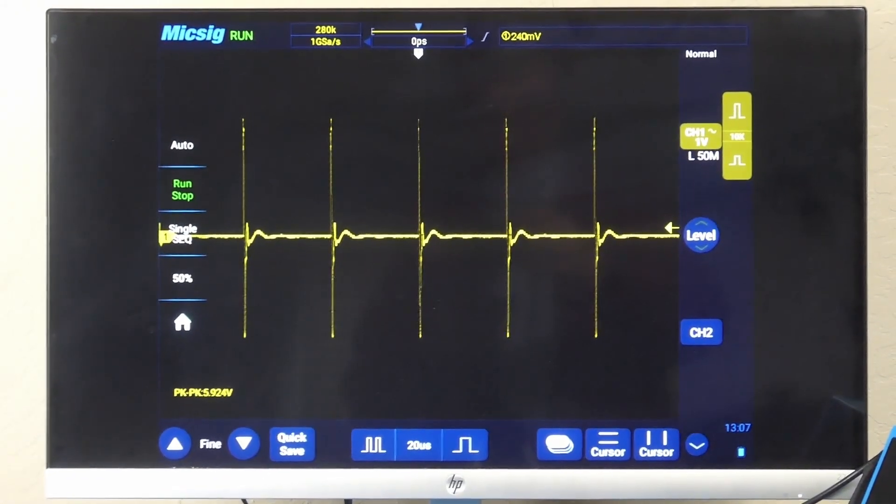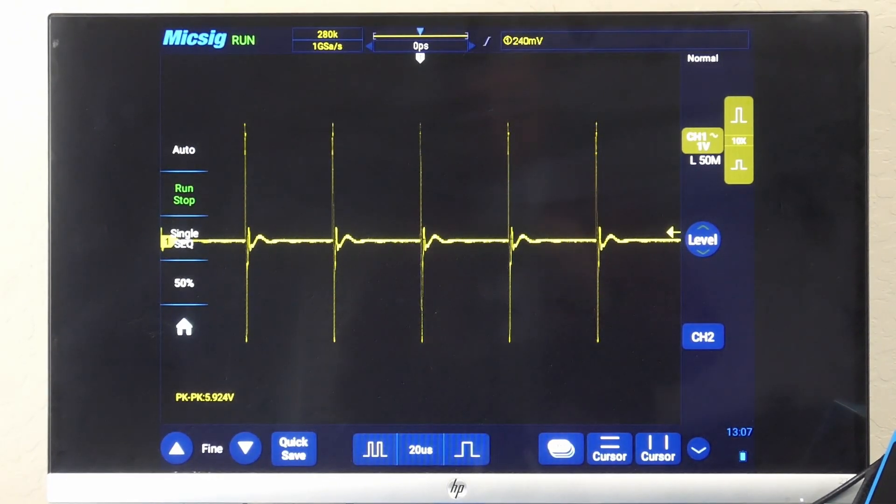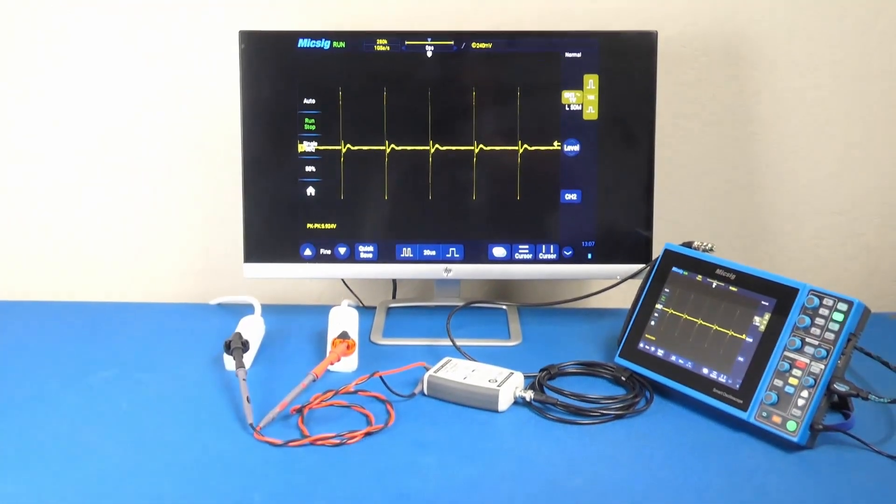As you can see, there is plenty of high-frequency voltage between these two grounds — close to 6 volts peak-to-peak. It appears that the source of this signal could be a motor drive, but this is not really important now. What is important is how our ground filters deal with it.